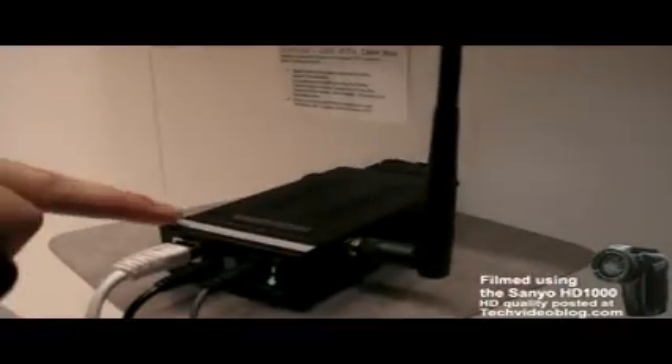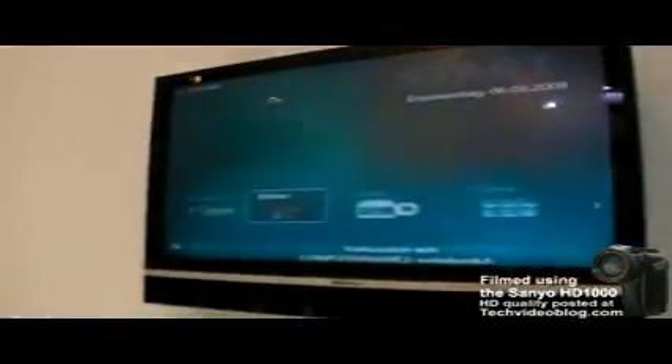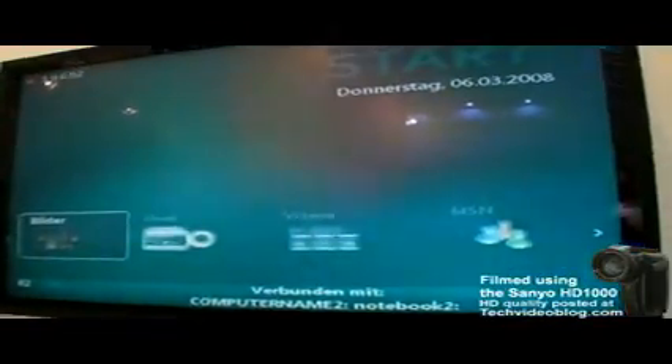You use Windows CE5 — is it based on MIPS or something else? Yes, the chip has three cores: one MIPS core and two DSP cores. The DSP can do all the video up to HD. This is the cheapest version. The business case for that box — you can see that on the screen now — is that it's connected to the TV directly using the SCART cable, and it's connected to the local network and the Internet. The box is doing the whole interface and just accessing media from the network.